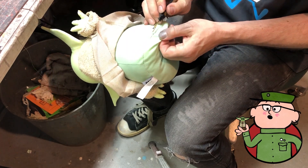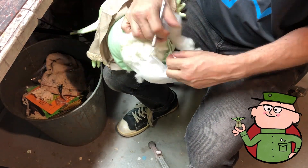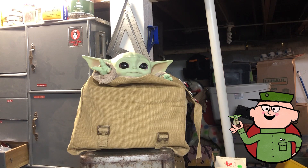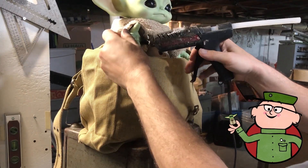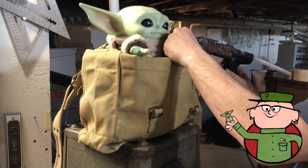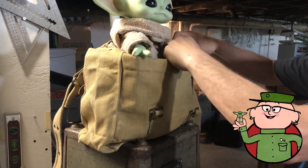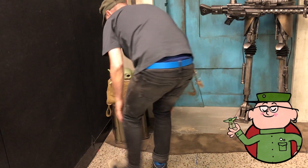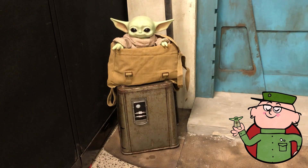Now let's remove Bayo's inner filling — he has a bag of plastic beads for weight and a lot of stuffing. Once I got it all out, I discovered there was a nice harder plastic disc around his neck area that already had a hole right in the center — perfect fit, and the mechanism has no problem lifting him. He's actually pretty light. I'm gonna glue his hands to the bag for some added realism; I initially used hot glue but that didn't stick well to his vinyl hands, so I'll end up using super glue. With his arms glued down, it makes his head ever so slightly turn as he raises and lowers — it's pretty cool. I think this one worked out all right. Thanks for watching everyone.